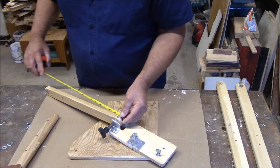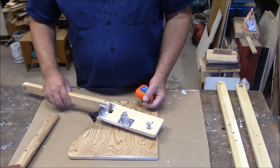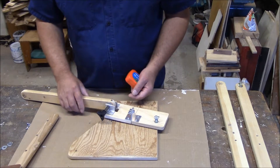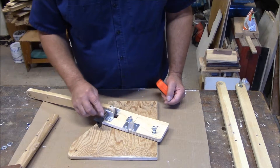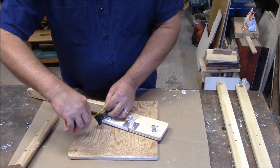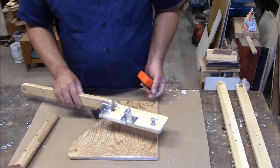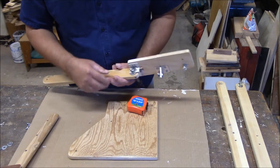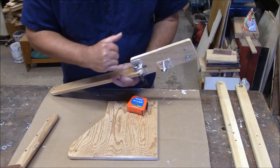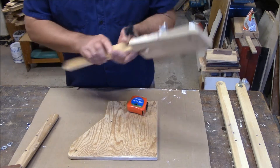This is the lower arm, and it's running at eighteen inches — but you make it whatever you need for your application. I put in a spacer; I found that was easiest for making an adjustment. That spacer is an inch and a half, and it's just a piece of tubing — whatever works. Here again I've got one of those anti-spin clips. You can see it's hitting the top, so this washer can't spin. It's bent over onto the head of the bolt, so now the bolt can't spin when you go to tighten it.